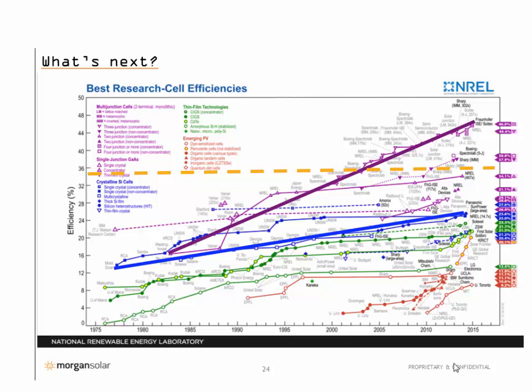The bottom curve is the trend line for silicon solar panels, which are also improving efficiency, but as you can see, slightly more slowly. So we are definitely riding this curve of efficiency improvement. Right now, the modules that we're building are not using the best cells in the world. We are working with a number of cell providers to get the best cells in the world into these modules, but we're using 2005 world record-breaking cells, and we're achieving a 30% efficiency. Once we get up into the current state-of-the-art of best cells, we should be able to push our efficiency much higher.